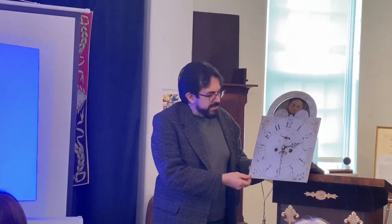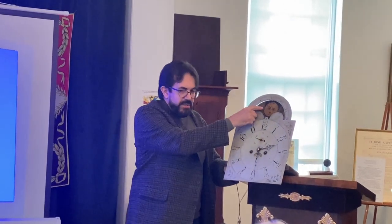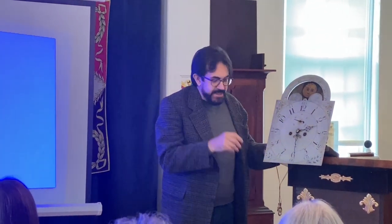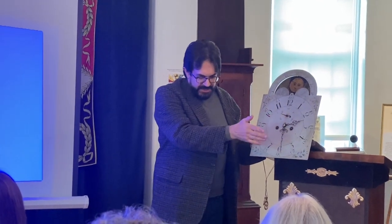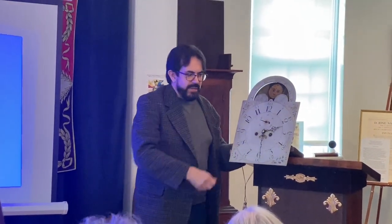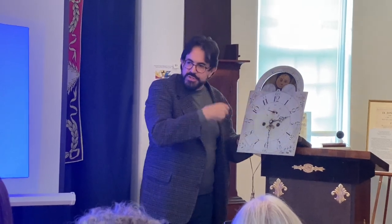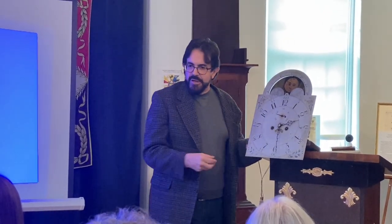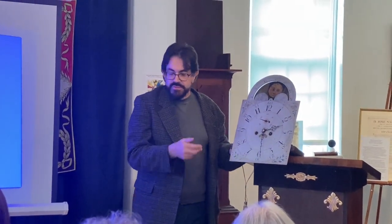This particular one is made in Birmingham. The sheet steel for the moon phase, the dial, was also painted there. In the 18th century, I've seen etchings of women, 24 to 48 in a line, painting the same dial. One paints it white, one compasses the circles on it, the rings, and then the other starts on the numerals and things like that. These were originally done in ink. And when people said, well, it's getting kind of dirty from the fireplace, let me wash that off, that's when you see these things with no numbers or no chapter rings, essentially.